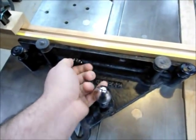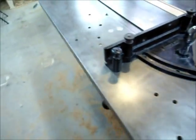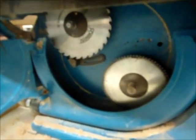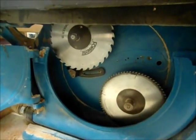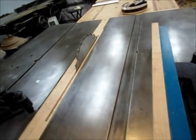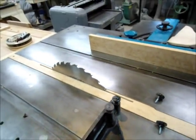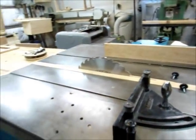That could also be useful for attaching to a standard miter gauge. Down below, the dual arbor can house two 16-inch blades or one 20-inch blade for an overall cutting height of 6 inches. Although I find the 4 inches I get with the 16-inch blade more than enough for most situations — much more than that could get a little scary, but I guess it could be useful from time to time.